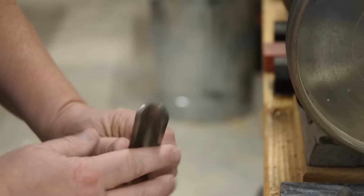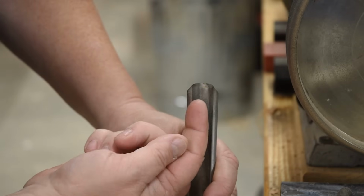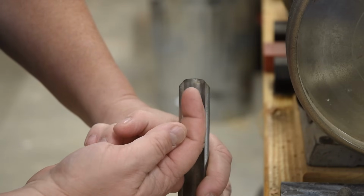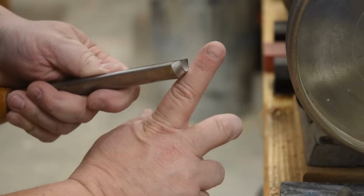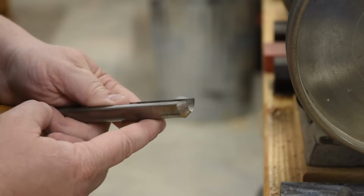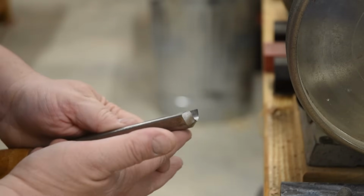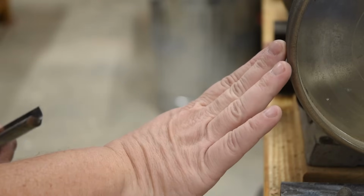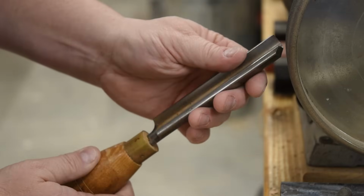Now, the spindle roughing gouge is basically sharpened straight across, so you don't have any angles on the nose as you do your other tools. And this angle right here, I do mine at 40 degrees for the simple reason I have a lot of tools that use that 40 degree angle. So I freehand sharpen a lot of this stuff, so if I can set a platform up at 40 degrees, all I have to do is come over here and go burp, burp like that.